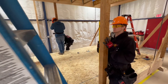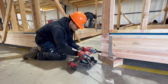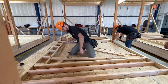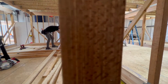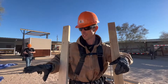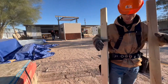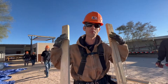This tool is for reading our blueprints — it has three scales: three-quarter, three-sixteenths, and one-quarter. Our blueprints are set to one-quarter inch per foot. When I come over to the framing I lay down my one-quarter scale to the blueprints, I can see the spacing — how many feet between windows and doors, how everything's laid out — and then I know exactly how many feet to mark on the actual floor plan. That's the key to understanding blueprints on a job site.